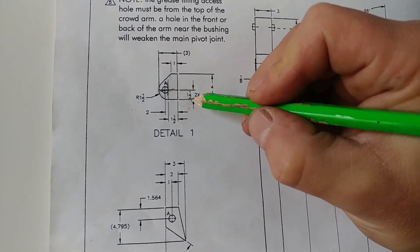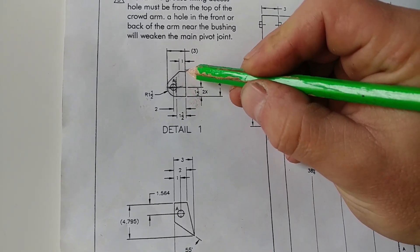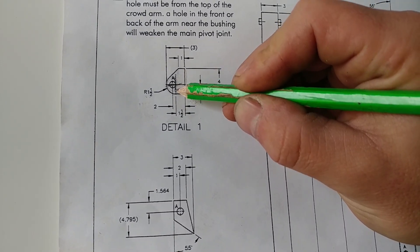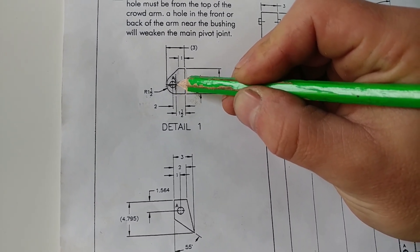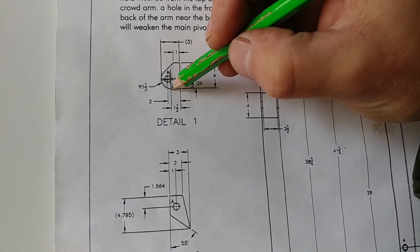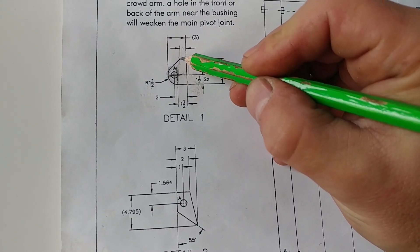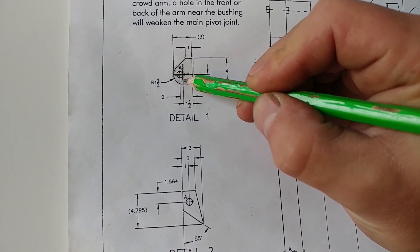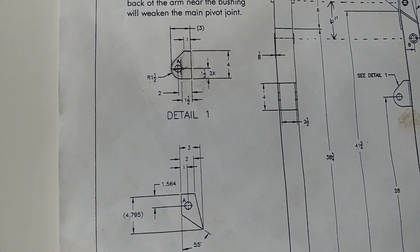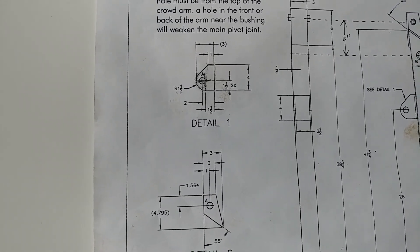To find that crosshair, go up an inch and a half — that's your horizontal line — and then go from the edge over an inch and a half — that's your vertical line. From there, take a compass set to inch and a half and round it off, then draw your line back and measure an inch straight to where they match up. That's where you cut. The compass radius is inch and a half; that's what the R stands for, and that gives you the radius from that point.